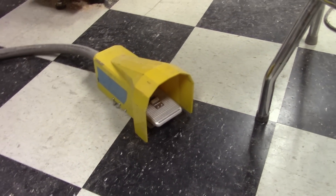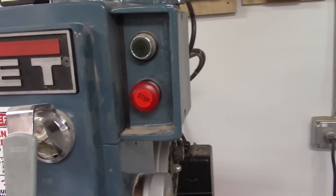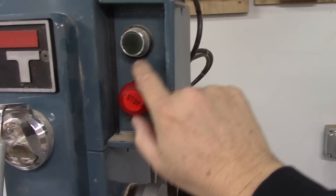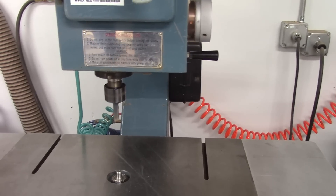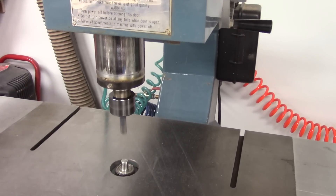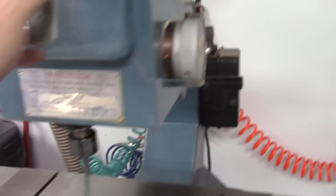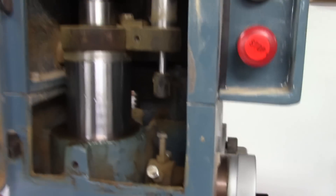This foot switch here operates the RAM. The Jet unit has a stop button and a start button. You'll notice when I press the start button nothing happens — that is because the stop button has a lock on it. You can click that out, push it all the way in and have it stay, click it out and you're ready to go. As you can see the router is now turning. I'm going to operate the foot switch and the RAM will come down just like that, and when I operate the foot switch again it goes back up. You can see where that would be super handy for plunge work.